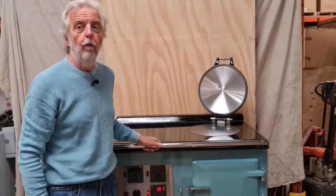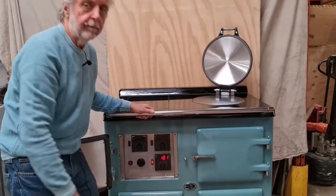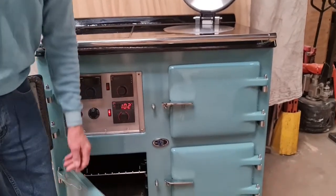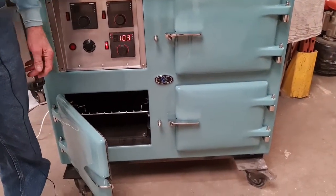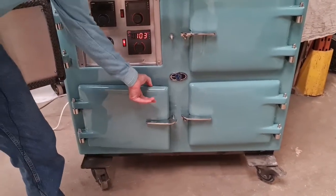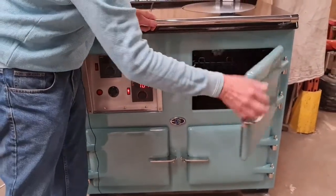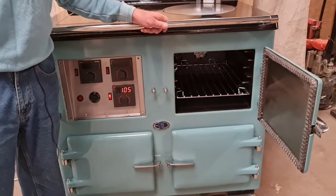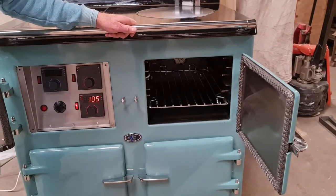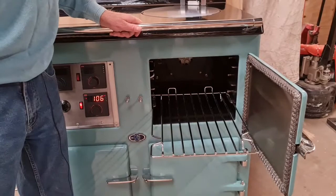The third oven, or warming oven, is just an on-off switch with this button here. It settles in to a temperature of around 90 degrees or 200 Fahrenheit in about 1 hour. All 3 ovens are a similar size to Aga cooker ovens, and all Aga cookware and racks that fit directly onto the oven rails of a traditional Aga cooker fit straight onto the racks of a Thornhill.